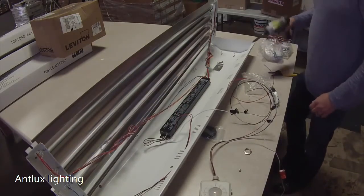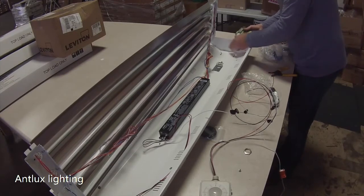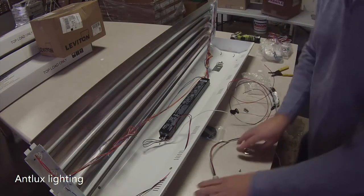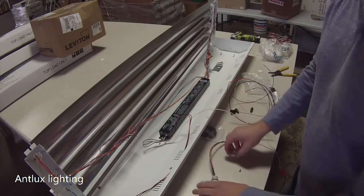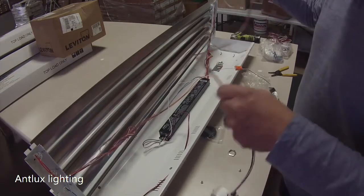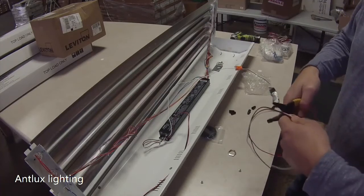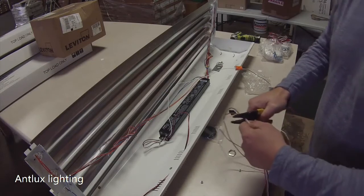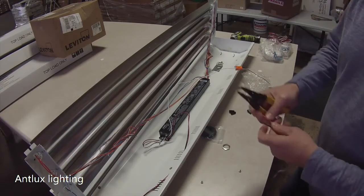We're going to pop an opening at this side of the fixture. I'm just using my screwdriver, whatever you need to use from there. We've already pulled off the nut on the sensor itself. And a lot of times I'll just cut the extra wire off of this because we don't really need all of it. It just seems to get in the way. So I'll cut it about 1.5 feet off, or 2 feet. Then I'll strip the leads.